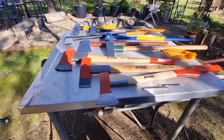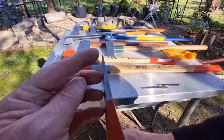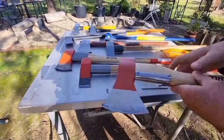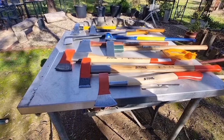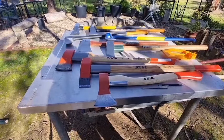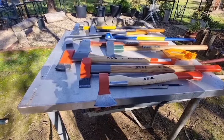If you have an axe and you didn't have a 30 degree bevel on it, what would happen, and if we look at this, if you were to have that thin angle all the way to the edge, when you strike hardwood, it would tend to damage the edge and even fold over. So you must make sure that you do have a beveled edge on there, but you don't have anything greater than about 45 degrees on a splitting maul. Fiskars use 30 degrees and they are razor sharp and they really do work good. So that's my best advice.